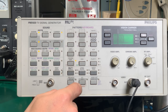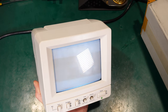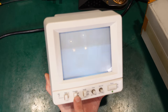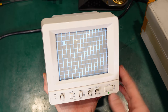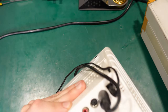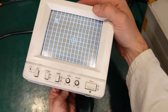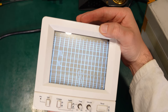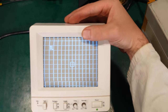Let me select some pattern — this is going to be a good starting point. I don't see anything at first, but that's because I was on the wrong input. Once I switch — yes, that was the case, we cracked the code. If you've got the vertical hold wrongly adjusted, this is what you see: the image is jumping. So you just adjust it until it's nicely steady.